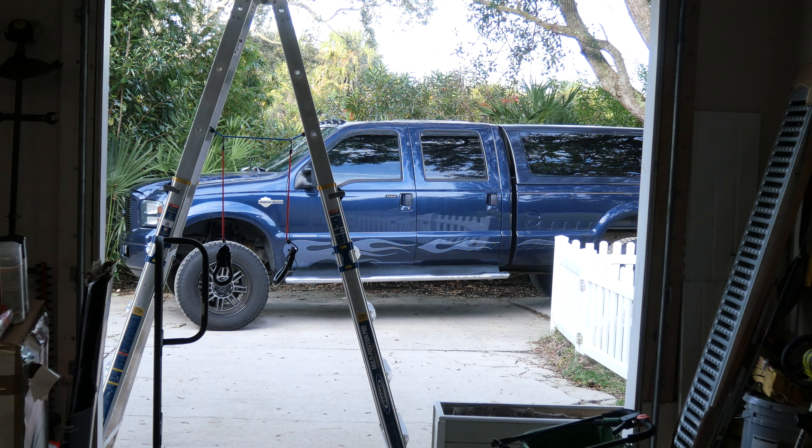I have them sandblasted to the best of my ability for sure. Still a couple little shiny spots — I think I'm going to hit them with some Scotch-Brite and get those all cleaned up. And then I'm going to tape off the threads. Then we're going to hang them and do some painting. So I'm going to mask the threads off real quick.